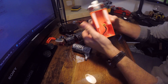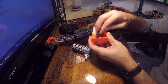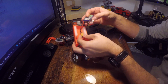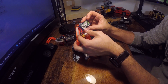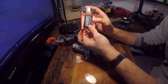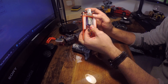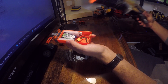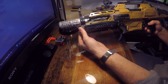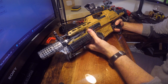I soldered the connections straight into the muzzle brake housing so that once you plug the battery in, as soon as you slide it in it turns on. This is a 3S 450mAh LiPo — I think these go for like three or four bucks apiece on Hobby King. All you have to do is slide it in and you hear the ESC starting up and then it's ready to go.